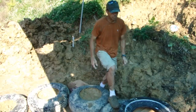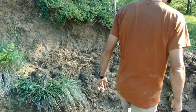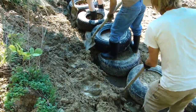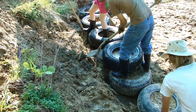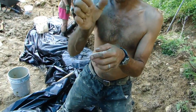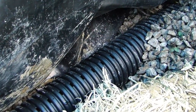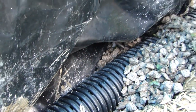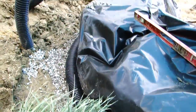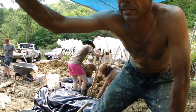Eventually we're going to break through this pile of dirt and run that pipe out that way. The perforations are just on top of the pipe, so when the water comes down the wall, it collects in the pipe. There are no perforations on the bottom, and the pipe is sloped so the water drains out just like a regular sewer pipe. We don't want it to percolate down into the ground — we want it to collect in the pipe and drain away from the building.